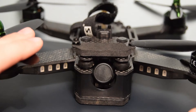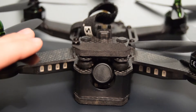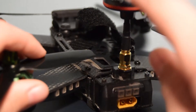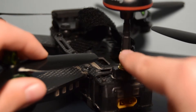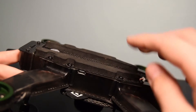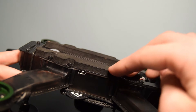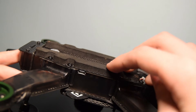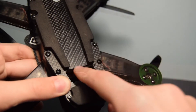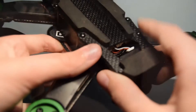This frame is built for durability and is set up for a beginner pilot, but you can tweak all settings on CleanFlight to make it suitable for an experienced pilot. I found that when placing the battery it was very close to the props and sometimes the wire was catching on the props making a ticking noise. On the bottom there is lots of foam padding, and extra foam is included in the box to keep the electronics off the ground. There is a hole that could allow moisture in when flying off wet grass, which could lead to malfunction.